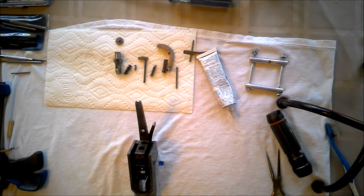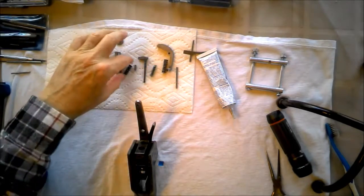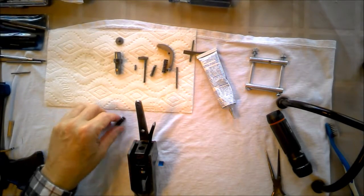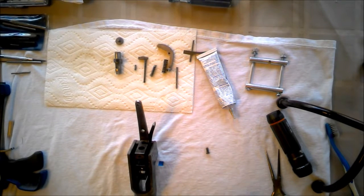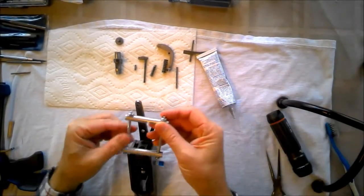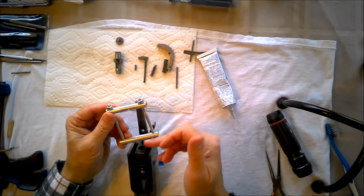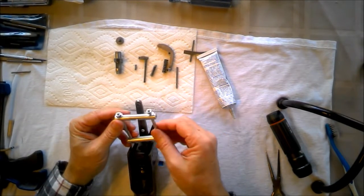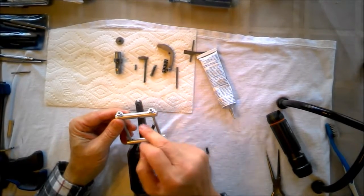All right, so next on this is the top lever spring that we can go ahead and assemble now. On this one in particular, I did have to make a tool for this. It's a pretty simple design. All I did is I have two pieces of 3/8 aluminum, and I believe I just used some standard stock and grooved this.